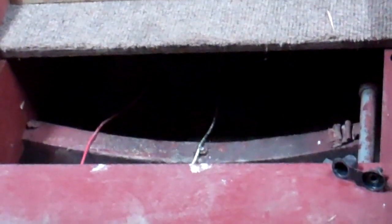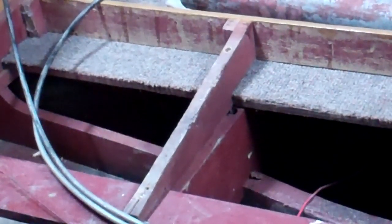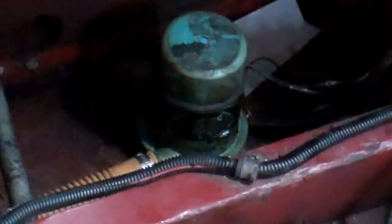Behind the dash panel it was basically a bird's nest of wires going from one gauge to another, presumably for power — probably 20 or better pieces of wire, with at most 10 going to any particular section of the motor. I plead with everybody: there's nothing wrong with swapping out gauges if that's your goal, but please take the old wiring out. If you're not going to use it, strip it out.